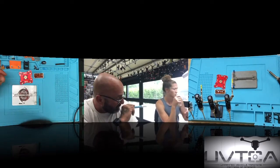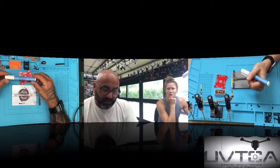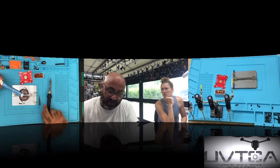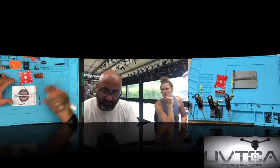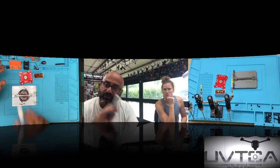Okay, look, that's the one thing you cannot do. Sorry. Even though it's not on, make it a habit to always put it up. I don't know if you could see that on her desk, but because it's not on, she just sat it down like this and went on. On or not, make it a habit. Please. As you get used to soldering, you'll sometimes forget that it's on, and next thing you know, you've burned through the desk, or you've caused a fire. So please be very careful.